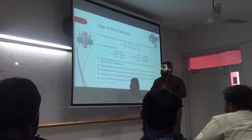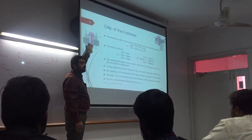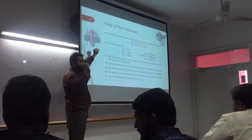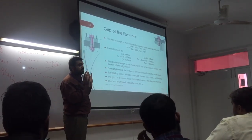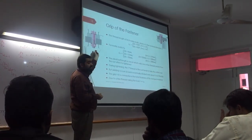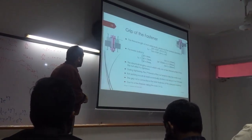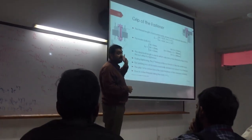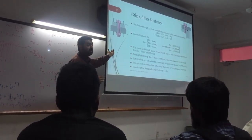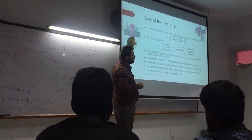The ideal length of the thread is that when you fasten this, the length of the bolt should be just enough so that the material is sandwiched between them. Ideally, the thread should be just so much that when you tighten it, just 2 or 3 threads stick out — and that should provide enough clamping. Generally, the load on these threads is shared by just the first thread. The others are not contributing to the clamping force, but there is some yield that occurs in the first thread and some load transfers to the second and third.